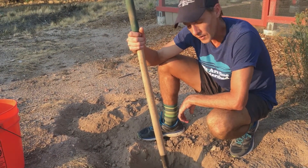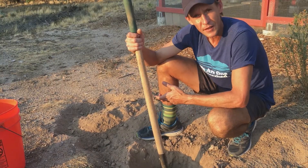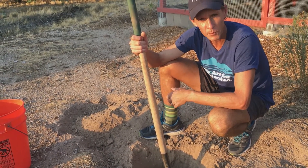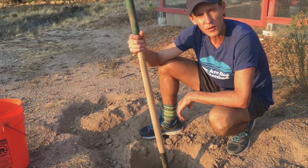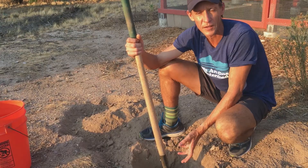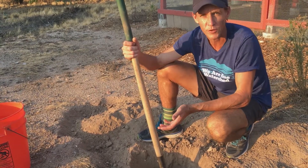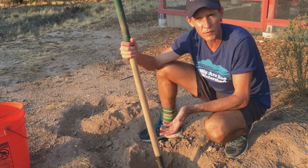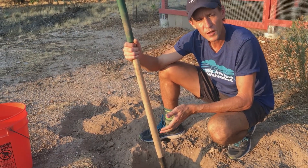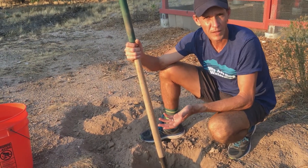The point of this is I need to test when the soil is fully saturated — as wet as wet can be — and still have water drain through my system so I'm not ponding it for over 24 hours, 36 hours, whatever the requirement is for where you live. That's to ensure that we don't breed mosquitoes and we keep our plants healthy.